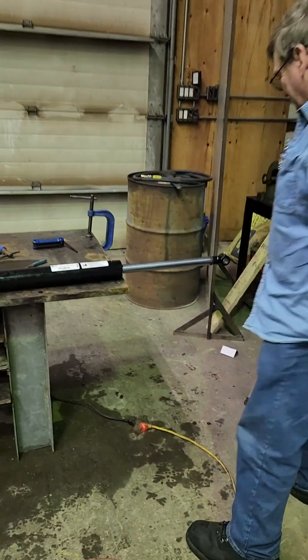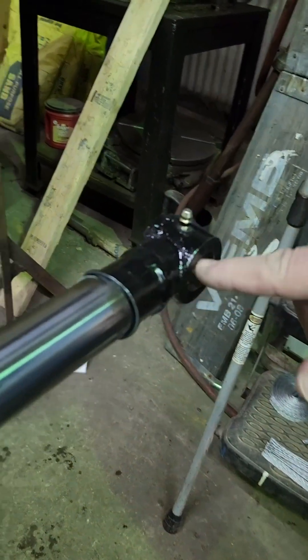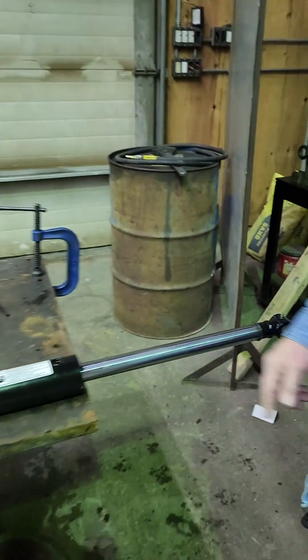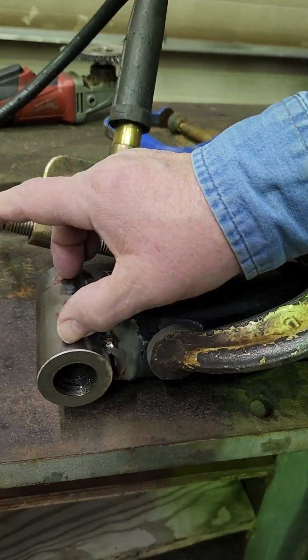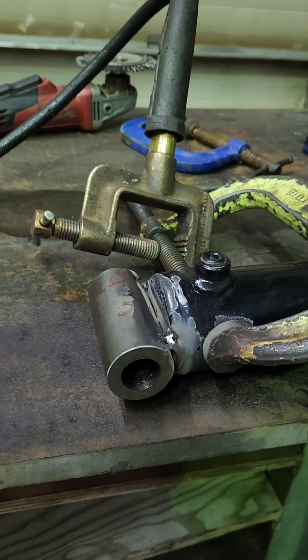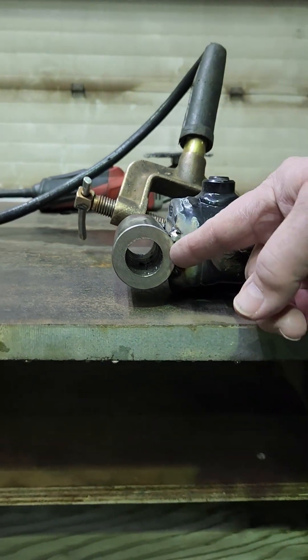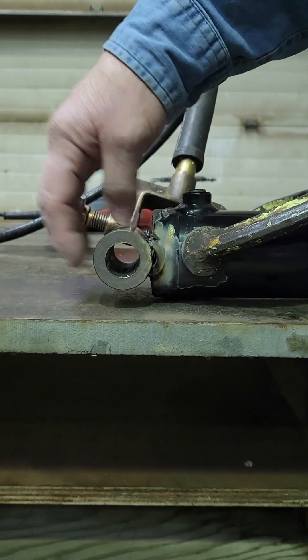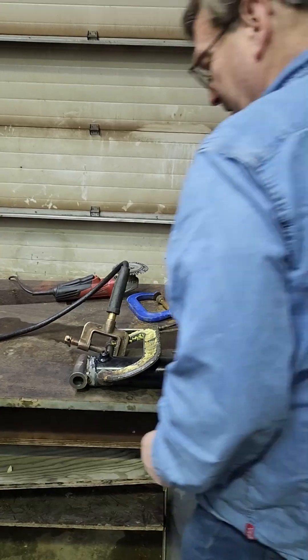We have a new cylinder, but it came with a three-quarter inch bore, so we bored it out to one inch. On the back, along with being narrow — which would have worked, and we could have just made shims for it — but again, it was three-quarter inch and that was not heavy enough. So we had to make this other piece that has a one-inch hole in it, just rough drilled, nothing critical that way.